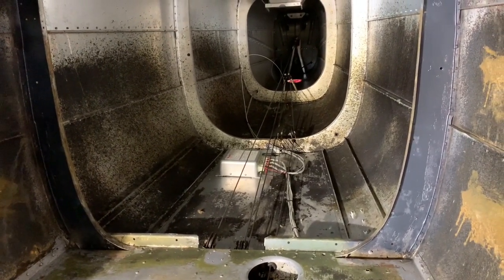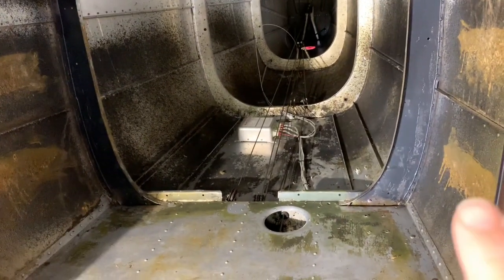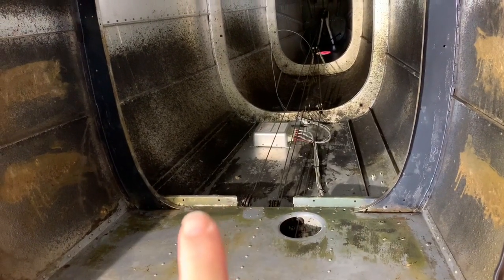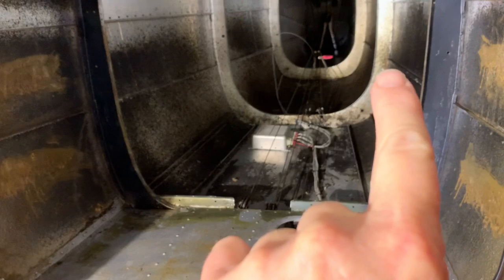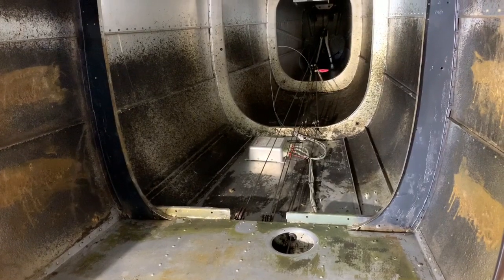The first step will be to fit the floor. We'll put the nut plates on basically here and here, and then eventually we will screw through back there and there to support the floor, making sure we maintain a quarter of an inch from those cables.